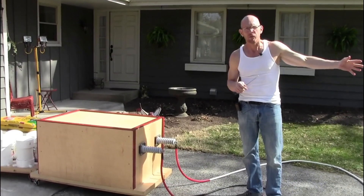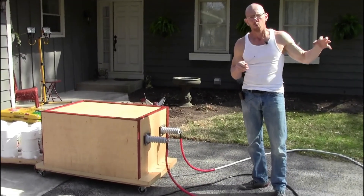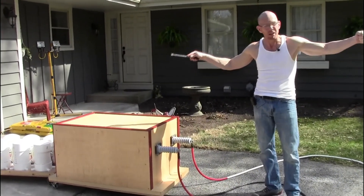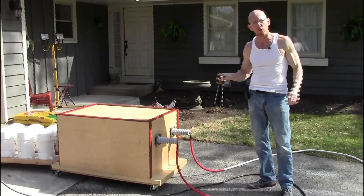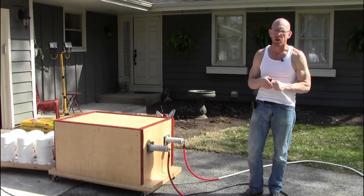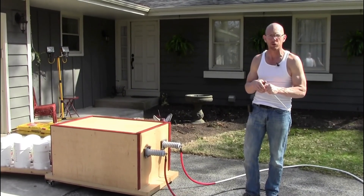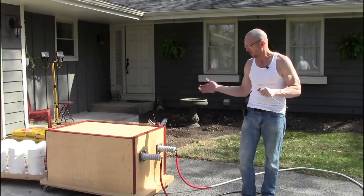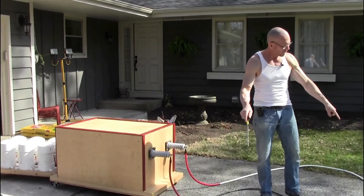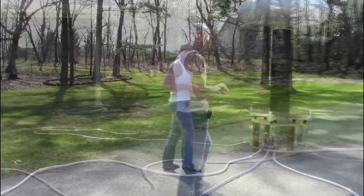Inside the tank circuit of the Tesla coil I'm utilizing capacitance which reacts with the inductors at the beginning of the circuit. Because of that reaction through the transformer bank, we see a resonant rise — a voltage boost of almost twice what we started with, amounting to about 30,000 volts. That voltage is fed through these white high-voltage primary cables down to the body of the Tesla coil itself.